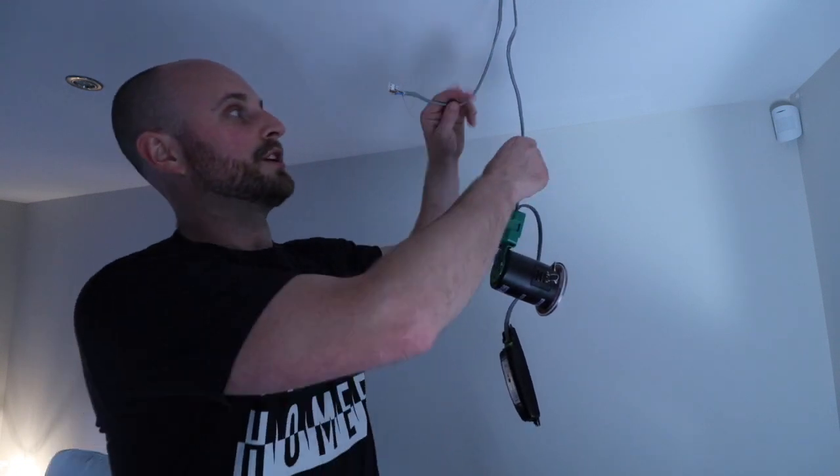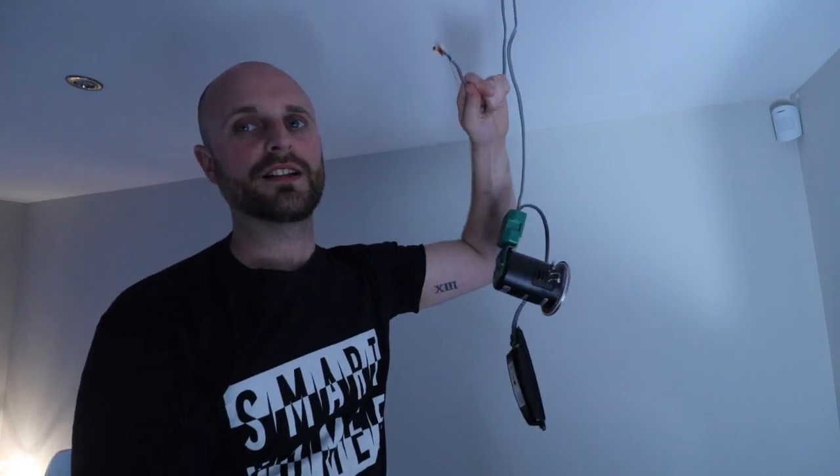As you can see, I've done a lot of pre-work already. As a qualified electrician, I know some of the ins and outs of what we should be looking at when putting one of these dimmers in line with some spotlights. We're looking for our first feed to the spotlights and everything's wired in series — from the switch to the first spotlight and then out to the rest of them. We've got five spotlights in our lounge and the first one is the closest to the switch, so I dropped it down and luckily one of the two incoming cables here was identified as a feed.